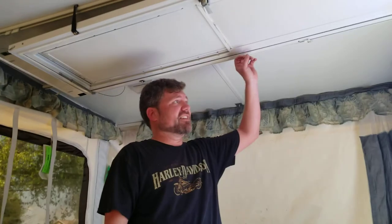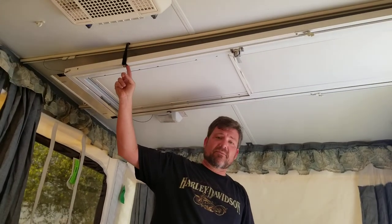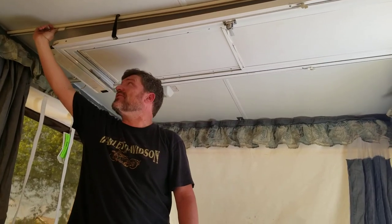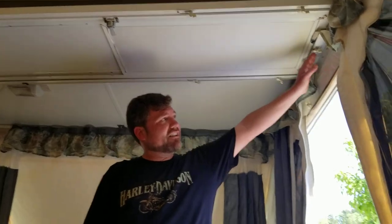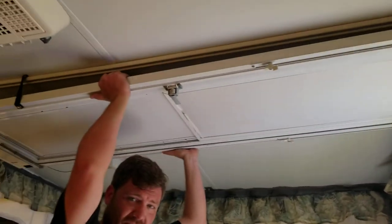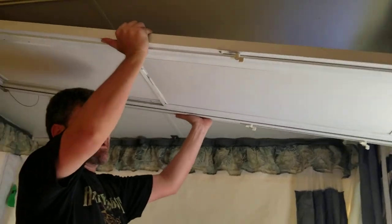Let's look up at the ceiling. The door hangs from the ceiling and there are snaps here that will unsnap. This thing also lives on a track — it's got a little cord over towards the right and little sliders on top that keep the door from crashing down. Step one: on the right side as you're facing the door, you'll see a little plastic clasp. Turn that and it'll pop up out of the hole. Grab it about in the middle, pull it up out of the hole and it's going to drop right down into place.